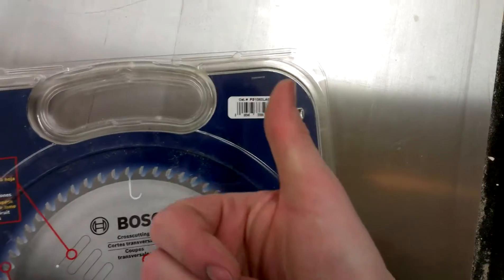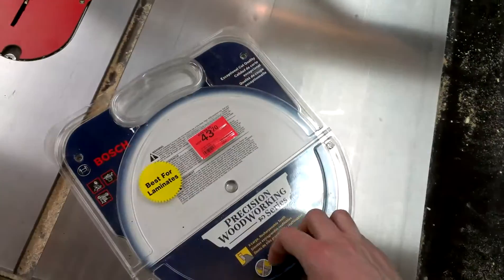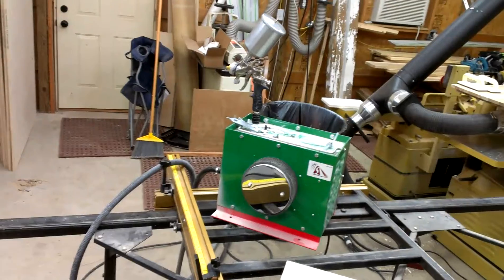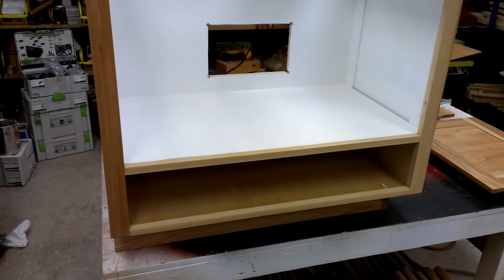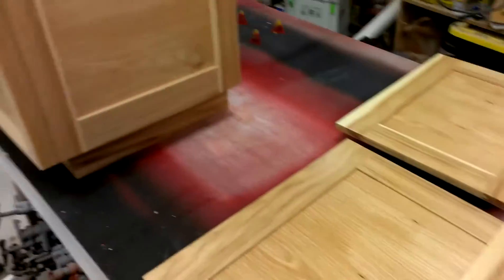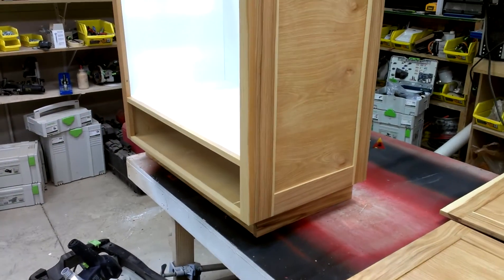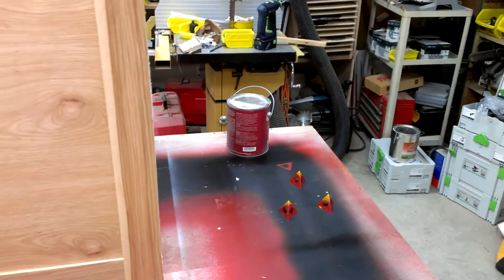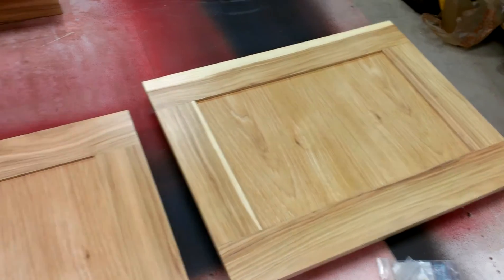It gets the Darlington Farm thumbs up. I'm guessing not everybody else likes them because they were closing them out, but I may go pick up the other two they had tomorrow. I've gotta go clean my paint gun, but hope you enjoyed, thank you for watching, please comment, rate, and subscribe, and let me know if there's anything else you'd like to see. I'll leave you with a shot of this cabinet — I really like the way it turned out. I kind of like the natural hickory look. The pre-cat urethane is a little bit yellow when you get a bunch of thick coats on it, but I think it goes well with this hickory.